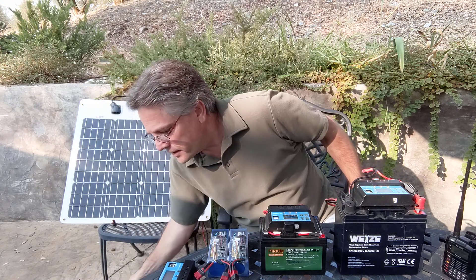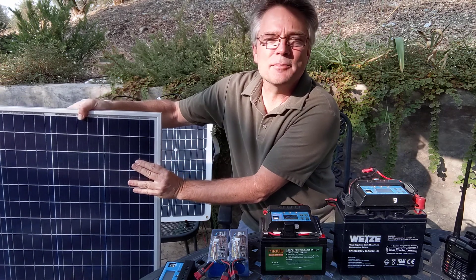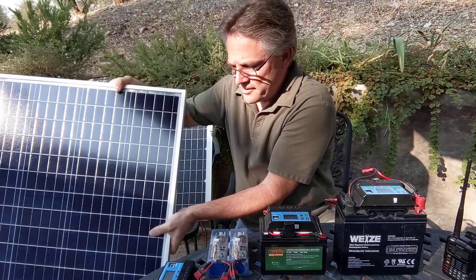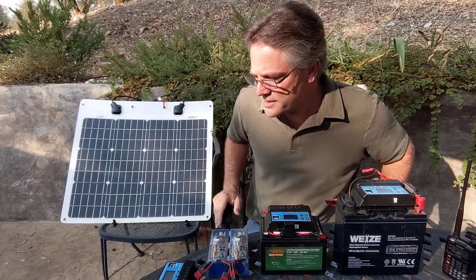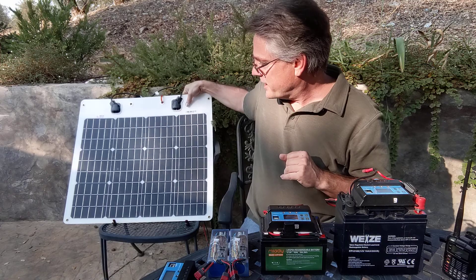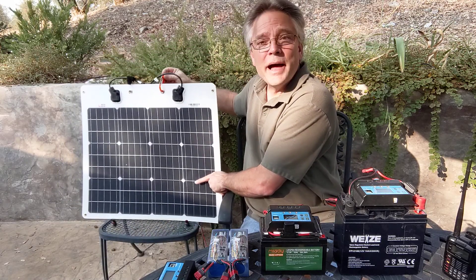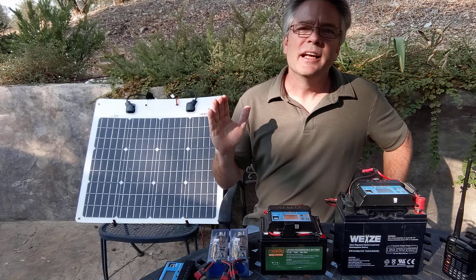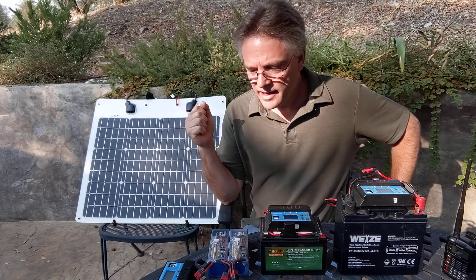The more traditional panel is this one — a 100-watt panel. They're about the same price, but this one is brutally heavy and produces twice as much power, so 60 watts in reality. There's a difference between monocrystalline and polycrystalline cells, though I don't think the difference is that huge. I like the 50-watt flexible panel because it keeps my battery charged for my operating habits, including digital modes. It's super light — you can clip it to a backpack. That's Rich Solar, about $75.